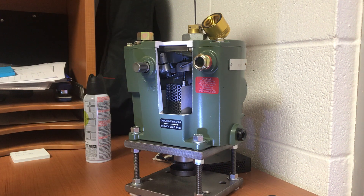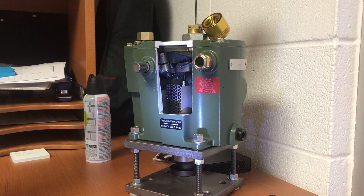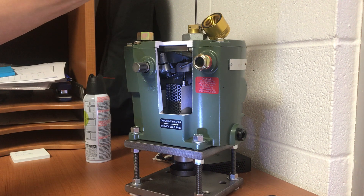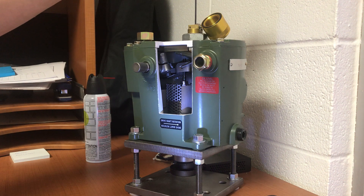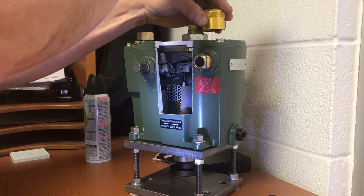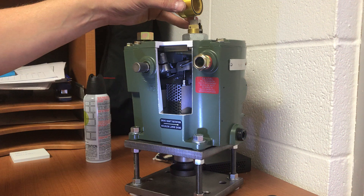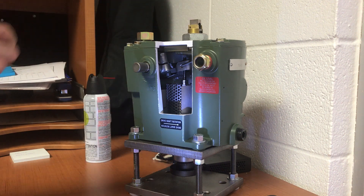Applying pressure down on the spring pushes down on the weights. What you're doing is overriding your 3,000 RPM, and now you can ramp the speed of the governor to trip your turbine. You just turn this, and assuming you hit 3,150, you've tripped your turbine at the speed you were looking for.